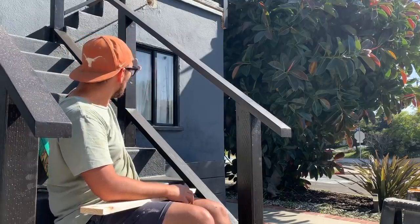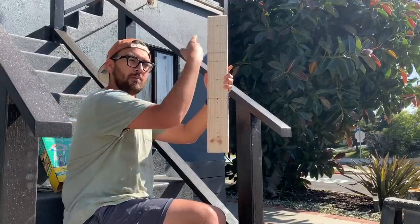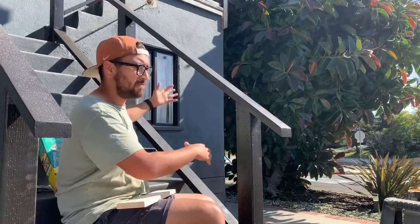Let's talk about the next section of my rail — it's basically going to be the same concept. As you can see, there are two different sections here. Instead of putting your turnbuckles in the middle, you're going to want to drill holes and run your cable straight through. You're going to drill your holes at 37-degree angles, which is kind of the angle of my rail — yours might vary. That way, whenever your cable runs through, it runs diagonally. Because if you drill straight, it's going to go straight through your post and then kick up — it won't look as clean. If you were to put your turnbuckles here and then start over in the next section, it's going to be nearly impossible to line up all your cables. So to give you that clean, even slope, you're going to have to drill through your middle post, or else your rail is going to look a little janky.